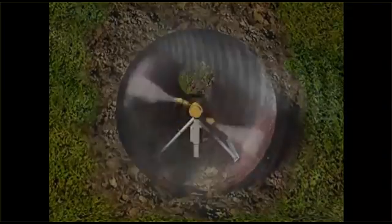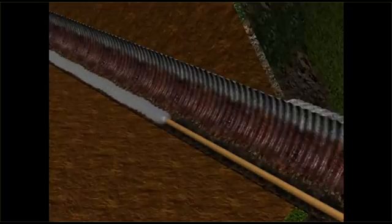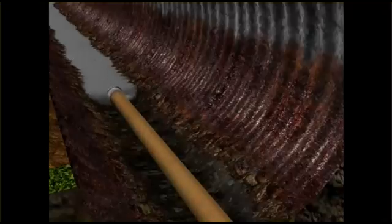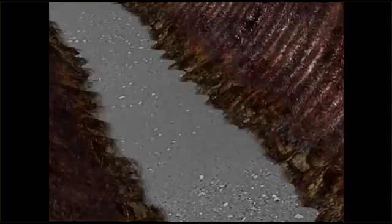In some cases, buckling, leaks, and inverts will have occurred in the existing pipe, requiring repair prior to spin casting. APM's self-consolidating PL12000 mortar is pumped into the damaged inverts. This permanently seals the bottom of the pipe, fills inverts, and makes a new structural base to keep water from leaking in or out — a necessary step many methods do not address. PL12000 leaves a new pipe floor that may be flat or contoured to the radius to enhance flows.